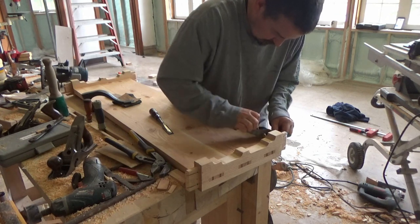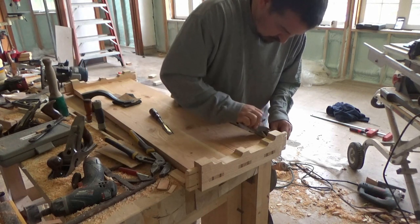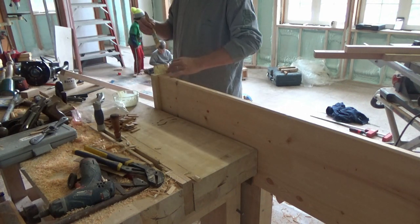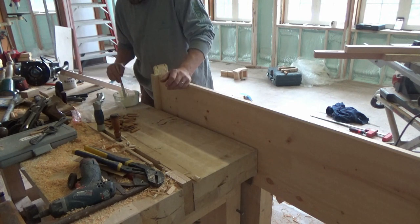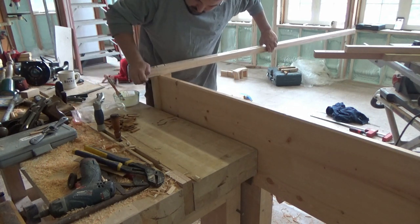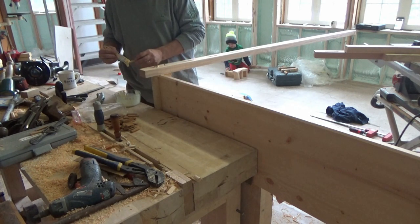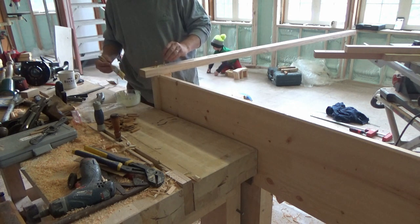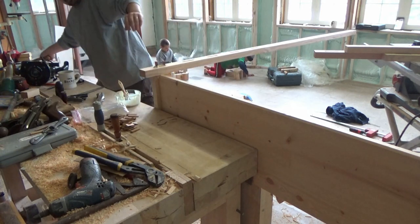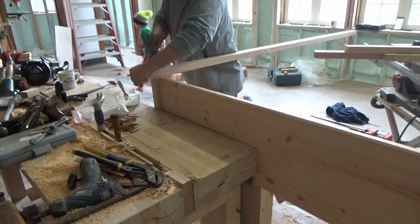You're not going to see any sanding on this piece. I originally started sanding the shelves but ended up opting for my card scraper instead, so this piece is completely finished with a card scraper. Card scrapers aren't super effective on softwoods, but on the end grain of those profiled rails on the bottom edges the card scraper worked really well at cleaning things up, as well as on the flush tenons at the shelf-to-rail connections. This piece is all hand-scraped top to bottom.